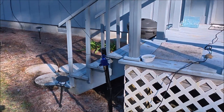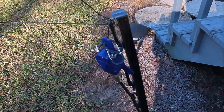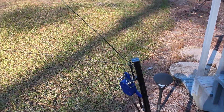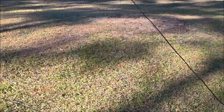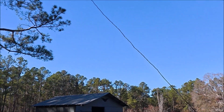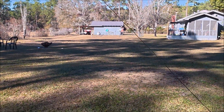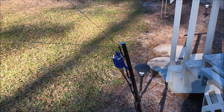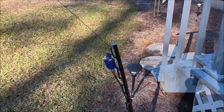If you get the bottom wire too close to the ground, it'll start to affect your SWR. Some people will say the corner is not exactly the best place to feed one of these, and that's entirely correct. However, with this light 22-gauge wire, if you bring the actual correct feed point down a quarter way from the top, the wire isn't strong enough to pull the droop out and feed it with coax — it just mechanically doesn't work very well. From the corner right here, you get pseudo-vertical polarization. The pattern is not symmetrical, but it works good enough.